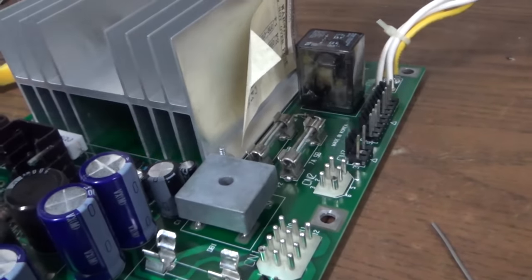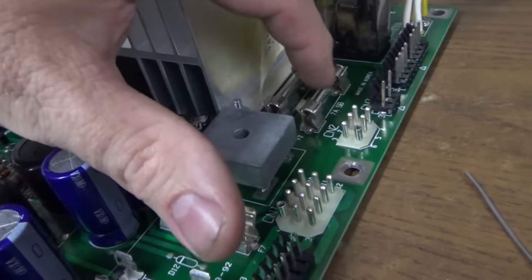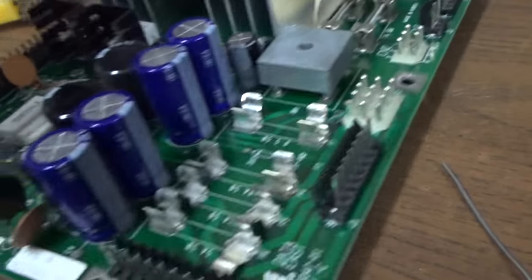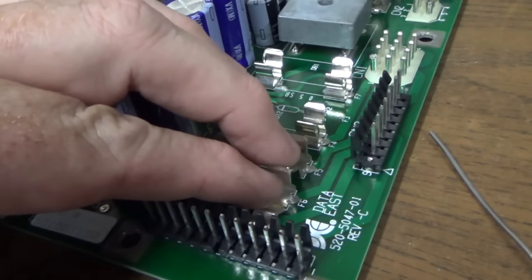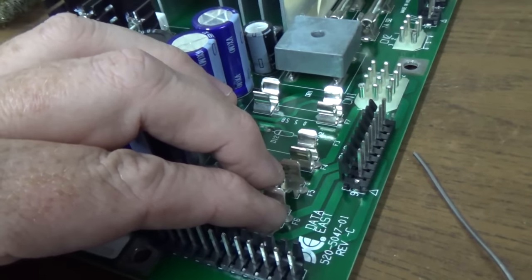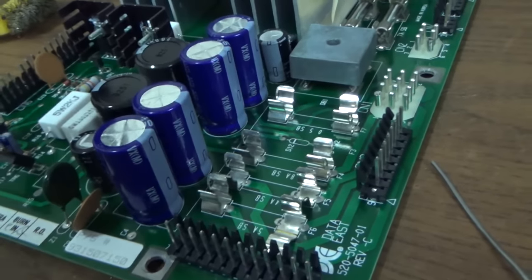All right, so there is actually no 5-volt fuse on the output. It's on the input, and it's these two. And they're both fine. There were two blown fuses, though. These bottom two were blown, which are the solenoids. So that would explain the T-Rex not moving, but it probably would have killed about half the other stuff in the game, too.